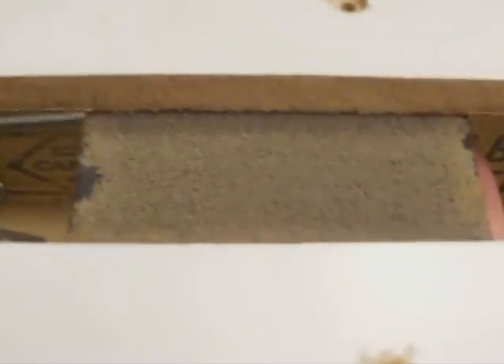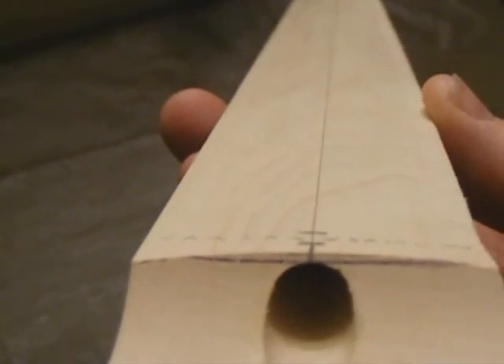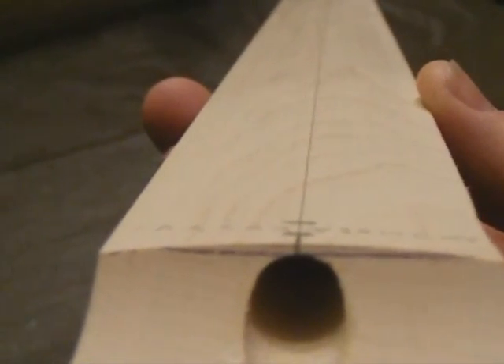What I plan on doing — I'm going to try anyways — is I have this piece of hard rubber for sanding and I'm going to make a block system to use in the jig itself. I'll probably have it run underneath just on top of the neck and use that back and forth to final sand it using the jig itself to keep my contour. Right now I've got just a little bit of material at the plug hole there, about a sixteenth.